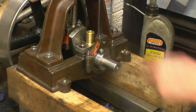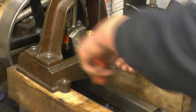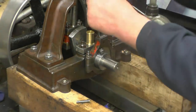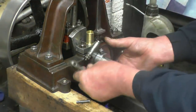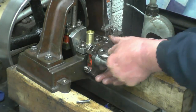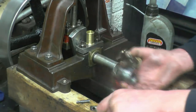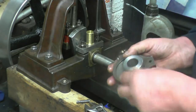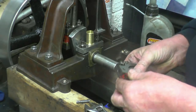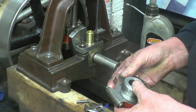I've put a mark on the assembly and a mark on the crank with an edge pen so I wouldn't lose the valve timing, because it's done quite nicely there. Take my pin out. There's no lift on it but there's quite a lot of side-to-side play on it. I wasn't happy with this when I originally made it and I haven't done anything about it, but I think now's the time to have a look inside it and see if we can take some of that play off it.